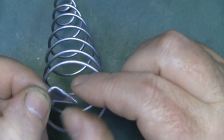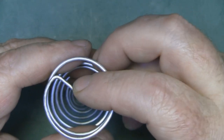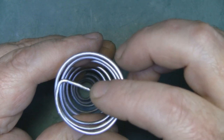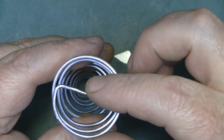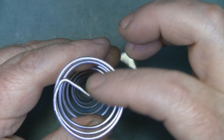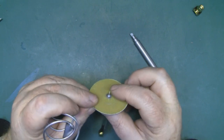I've got a small shim cut from an old tin — a cookie tin or baked bean tin — measuring 15 millimeters by 10 millimeters, and I'm going to solder it in position to bring the impedance matching down to 50 ohms for Wi-Fi or FPV. Some cheaper Chinese helical antennas don't have this metal balun — they just use a straight piece of wire and claim that's enough for impedance matching, but I can't find any reference to that approach in any of my books.